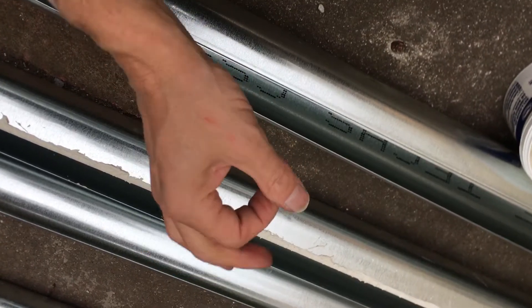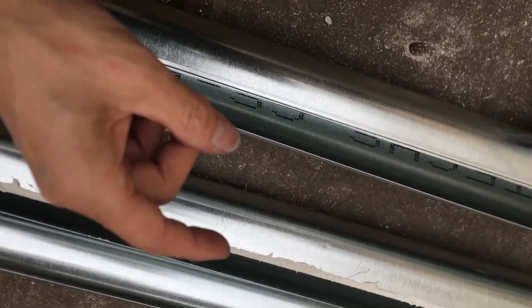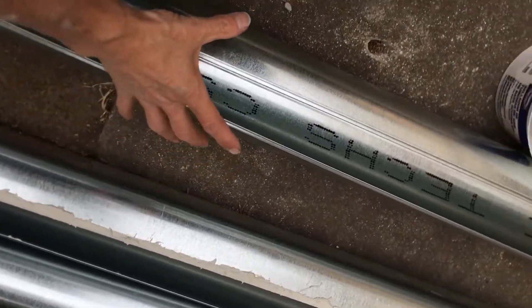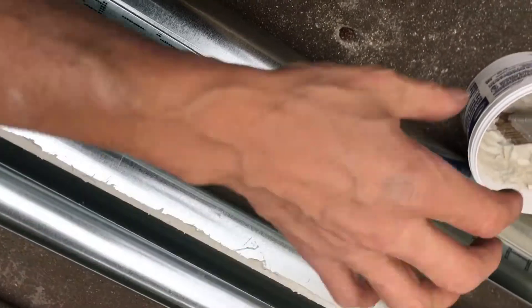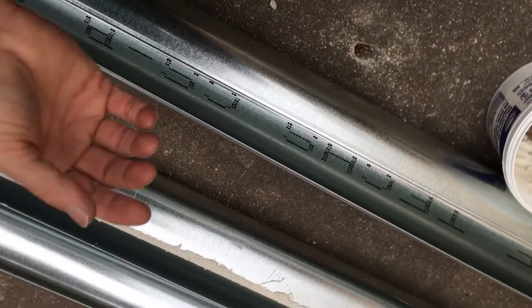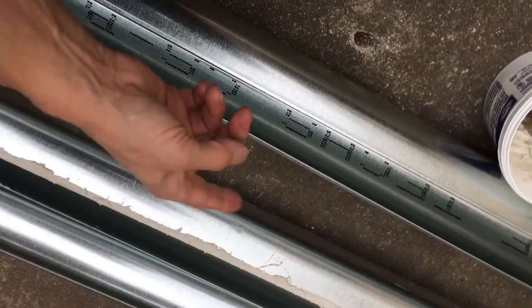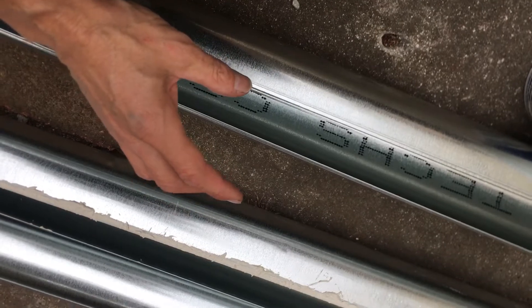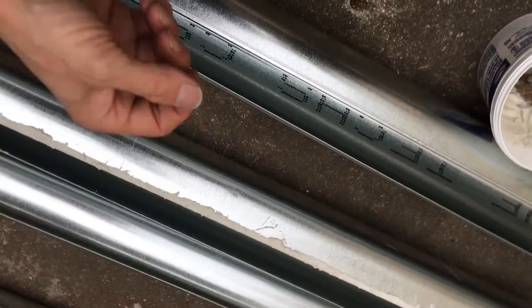We don't consider CO2 as dangerous, but at high enough levels it's a dangerous gas. In this situation, they used some flex duct that had many 90-degree bends in it, and it was drooping and filling with lint. Eventually, when the old dryer burned out, they just disconnected it from the vents coming from the back of the house and dumped the burning exhaust gas into the living space.